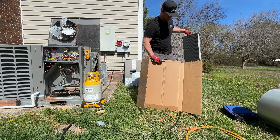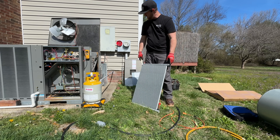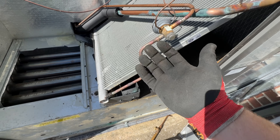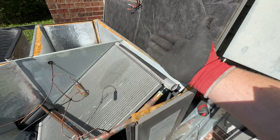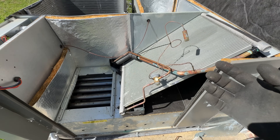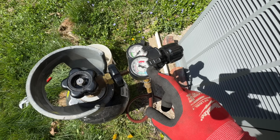There's a little bit of adhesive or some weather stripping tape, and you kind of just pop it loose. You just have to disconnect your vapor and liquid line and should be good to go. What I like to do whenever I'm replacing coils or really any kind of components is open up the new one first and see what the connections are, so that way I disconnect it properly to set me up for success when reinstalling. It just has the stubs on both sides, so now I know where I need to disconnect from the existing one.